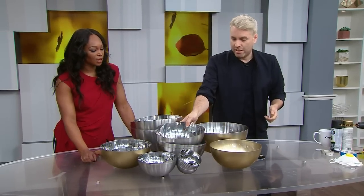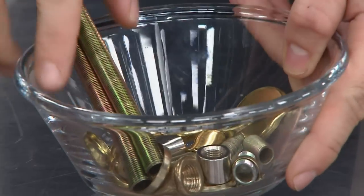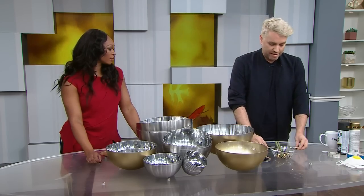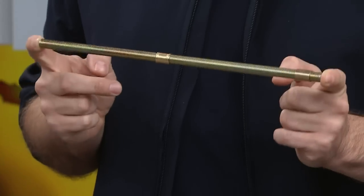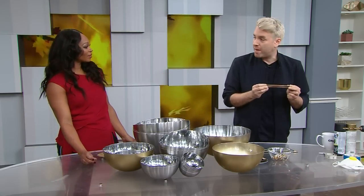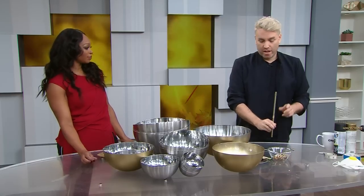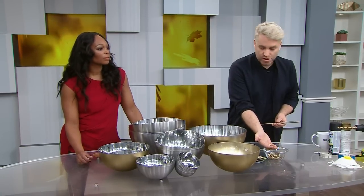The next thing you need to do is go to a hardware store and get some lamp parts. There are all sorts of assorted lamp parts, easy to find. The one thing you're going to need is called a 10-inch threaded nipple. It's called a threaded nipple — I know you shouldn't go to Home Depot and say 'can you show me where the nipples are?' It causes lots of confusion in the lamp section. They come in multiple sizes; shorter ones are usually for ceiling pendants, but we're going to use one designed for a table lamp because we want a longer ceiling pendant. You can also find assorted connectors, washers, and different parts — it's not that tricky.